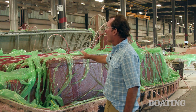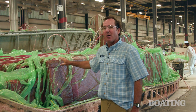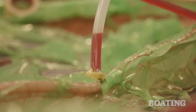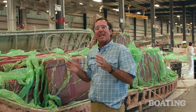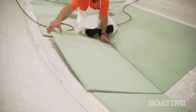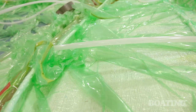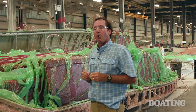So I'm standing in front of a Cobia 280 center console deck, and it's actually undergoing the infusion process — our VARIS process — which stands for Vacuum Assisted Resin Infusion System. Without a doubt, this is the very best way to laminate a boat. As you can see here, we have resin that is actually being pulled through the part, and this is what differentiates vacuum infusion from open layup, which is a more typical way to build a boat. It all starts with laying the fiberglass into the mold completely dry — meaning without any resin in it whatsoever. You also put in all the stringers, all the backing plates, the core materials, all at one time. Then you pull a bag over top of it, pull a suction on that bag, which pulls the bag down into the mold, compresses those laminates, and melds all those layers into one monocoque structure. Then you pull resin through the whole thing via vacuum.